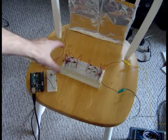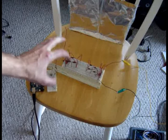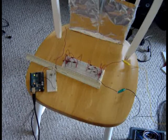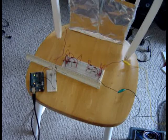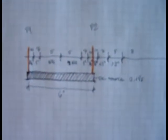I did a quick reading on the oscilloscope and I think I'm getting 5 volts here — my divisions might have been off, just a quick check. Here's my EMF sensor. I had a bit of drama: I think I burnt my analog pin 5 on my Arduino. I carelessly touched the EMF detector to the 14 volts, and that probably didn't do my Arduino any good. It was just pinning at 20 — arbitrary units. I've since started using pin 4 to verify.